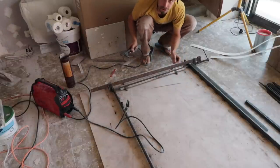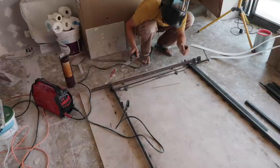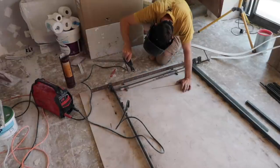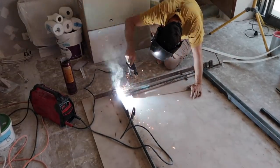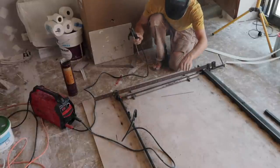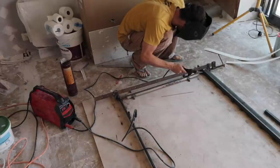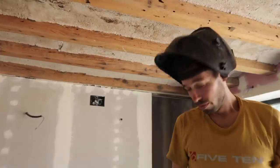I'm happy with the alignment — I know it'll fit with what goes on upstairs. It tends to be a little hard to get the arc going the first time. What I'm doing is weaving up and down across the joint to weld both parts of the metal. With these machines you pretty much need to just play around — try it with some bits of metal first, as thin metal is very easy to melt, so settings are really important. It just takes a little bit of time and messing around, but it's quite fun and I'd definitely recommend giving it a go.